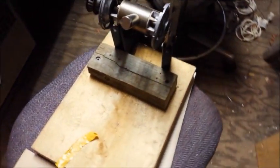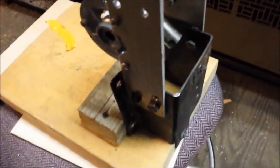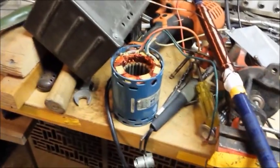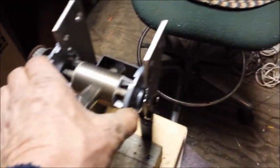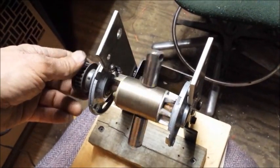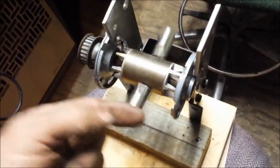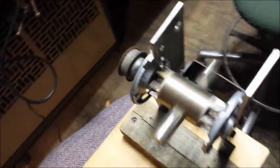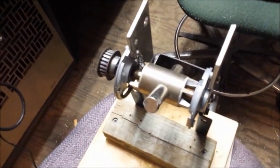With a little black frame I got off a lawnmower, there's two pieces of aluminum mounted to that. Then there's this motor that I pulled apart and kept the bearings, the rotor, and the pulley. I mounted the bell ends and housings on these aluminums. The magnets go right on the rotor itself, so I can spin it and put little coils up against the magnets as they go by — hopefully generating enough voltage to charge a car battery with a water wheel over a long period of time.